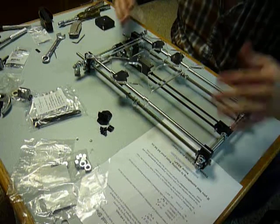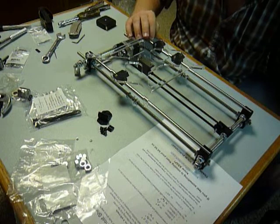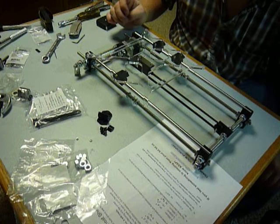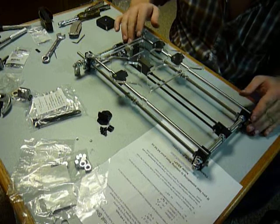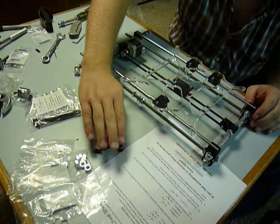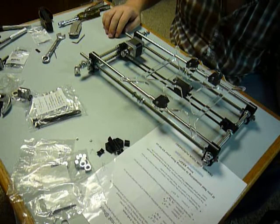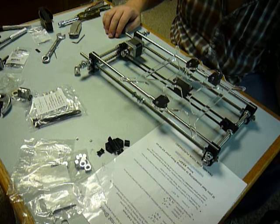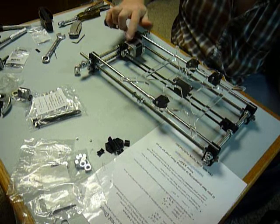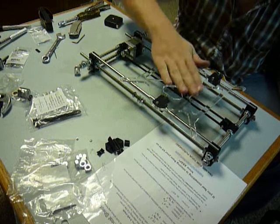Also make sure that you don't have any rocking — you will be able to adjust that slightly by tweaking a little bit. But yeah, this thing is together now. We'll see if I'm eating my words, but I hope I don't need this piece — fingers crossed. Moving forward: by the way, this is the larger of the stepper motors, so do keep that in mind. If you have different sizes in your kit, the larger one goes on the carriage.